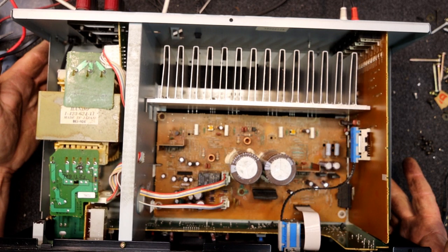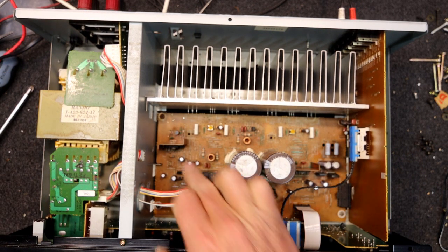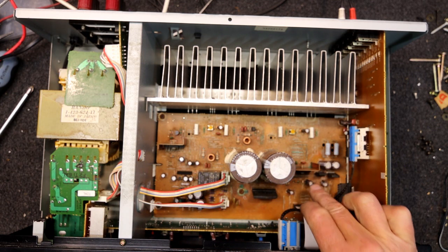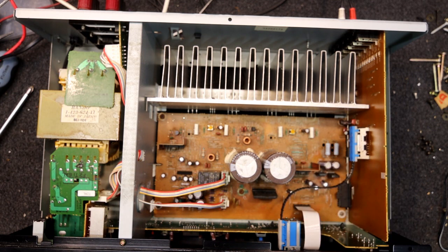It's surprising because that side is in much worse condition and yet it seems to work better. It's possible water's got into that chip — I would have sworn that would be the faulty one because it's got green corrosion actually on the pins of the chip. Water can work its way in between the copper backing plate and the plastic front, get into the chip substrate or up the pins and cause it to play up. But surprisingly it seems to be working.